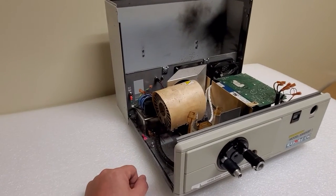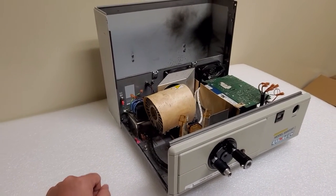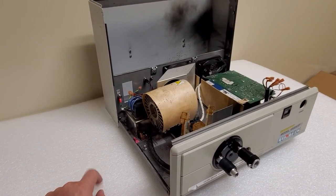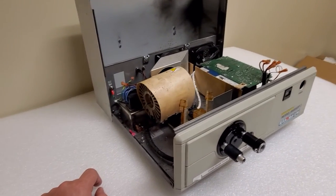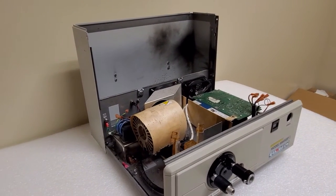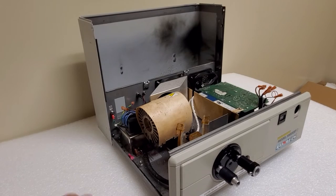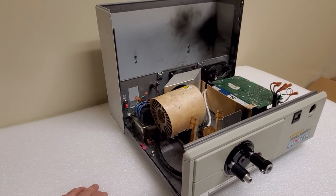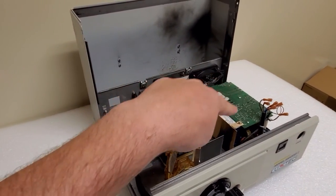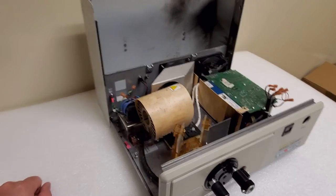Here is my problem with a lot of PMs. There's certain things that catch fire and certain things that don't catch fire. You would think that we would invest a lot more time in the things that catch fire, because they get hot and they're used in delicate areas. But that's not how it is. A lot of people see light sources as a quick and easy PM - they just run up there, maybe do an electrical safety, and press on. They fail to realize that if you pull out the bulb and check it, you can see that it was going to fail - it's got burn spots on the inside. The fans obviously haven't been vacuumed in probably a few years, and the heat sinks down on the power supply are chocked full of lint. So even if you do have good airflow, it's not going to be good airflow through the heat sink.